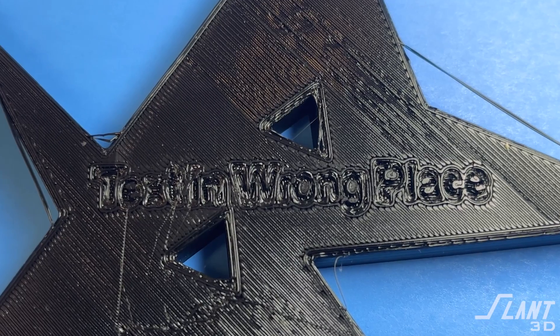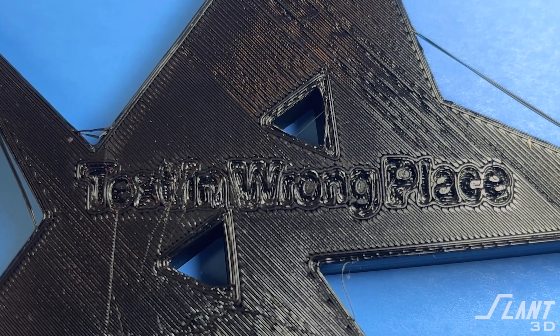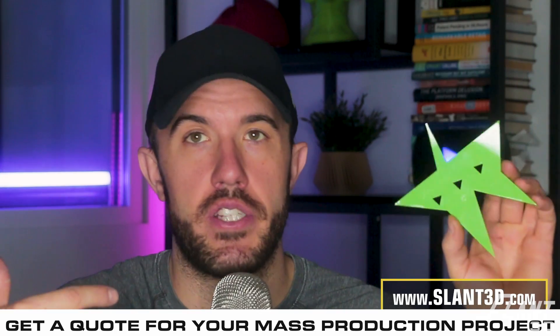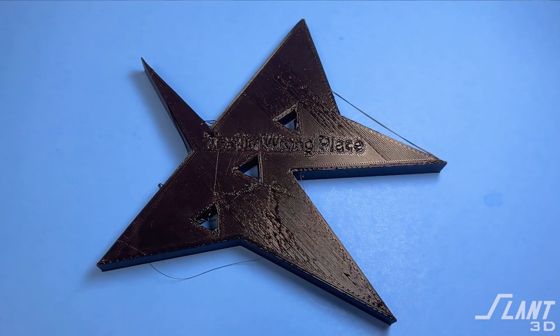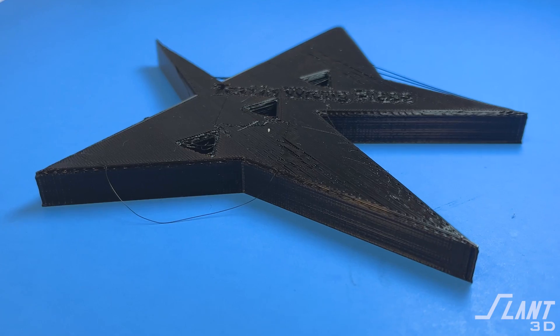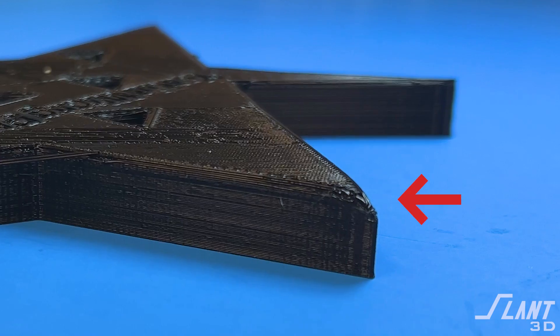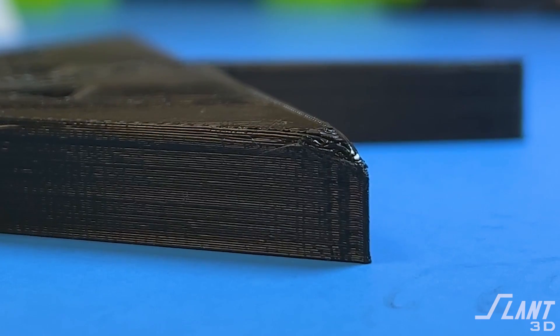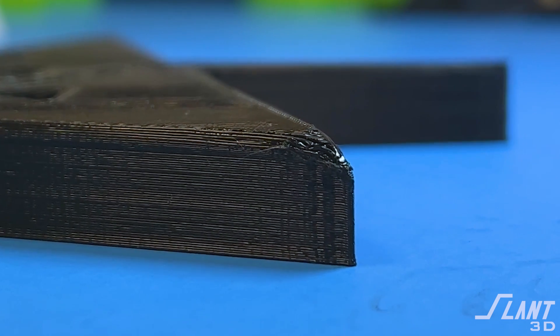This raises the cost of your parts over mass production and definitely increases the amount of waste. Now, the outer edges of this part have no rounded corners. This is very difficult on a first layer because the nozzle will go to the tip of one of these corners and then has to radically change direction. Not only does this slightly increase print time with a near full stop and re-acceleration, but it can also cause a failure because that corner has so little contact area with the print bed that it can drag backwards and cause deformation or warp.